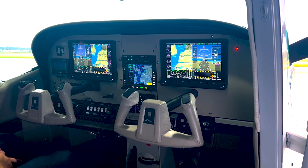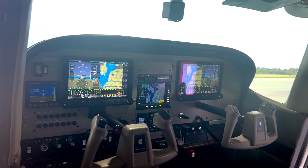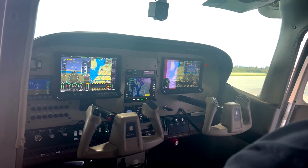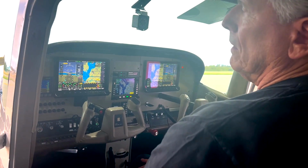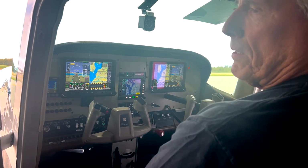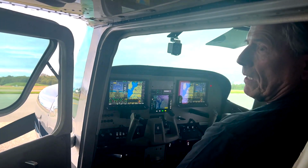And you've got a long time before that would occur. Right, you've got triple redundancy, plus you've got the Avidyne 550 in there, which even gives you more in that respect. That's correct. And I chose the 550 because it also has AHRS, Attitude Heading Reference System. So I get a redundant feature to the attitude information shown on the SkyView HDXs first, and then also on the backup, the D10A.